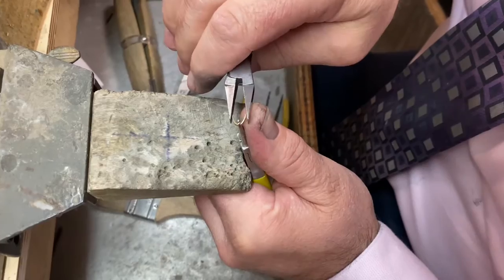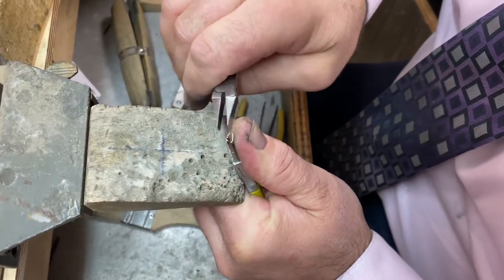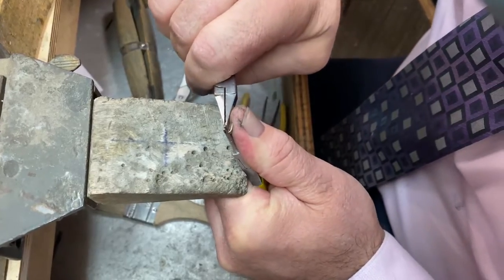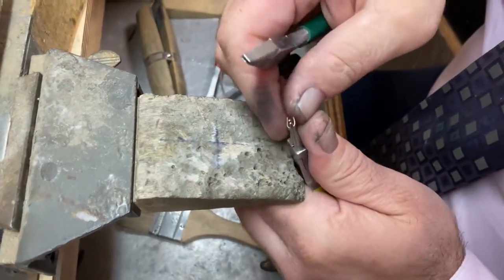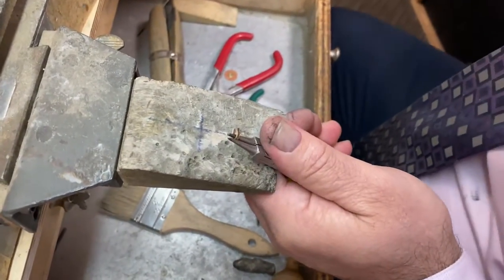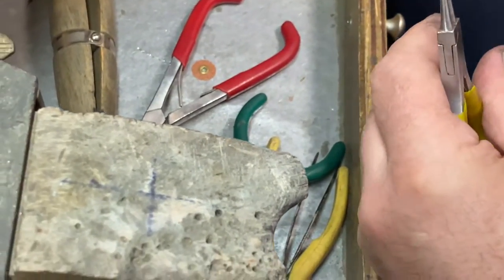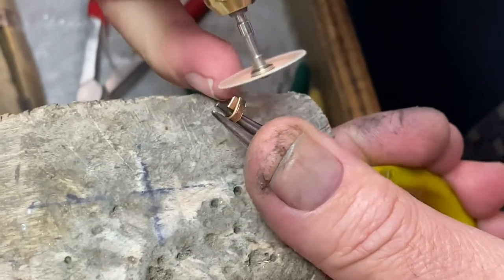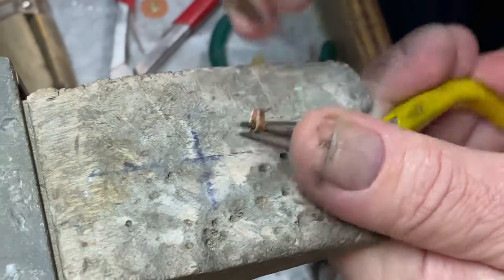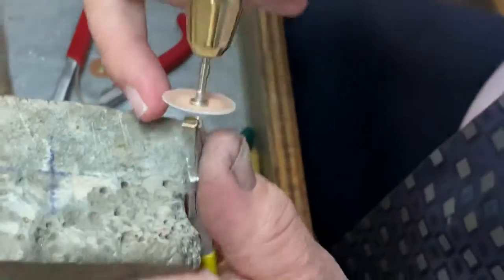When I do this I'm going to bend it down just a little bit to give it a nice shape. Very similar — then we can grind it as needed. I always leave extra material so you can grind as needed. Make sure you grind the slat on each end; you could round these off a little bit if you like. Honestly it doesn't have to be exactly perfect — you can grind it as needed.